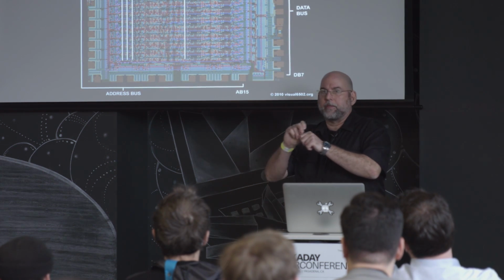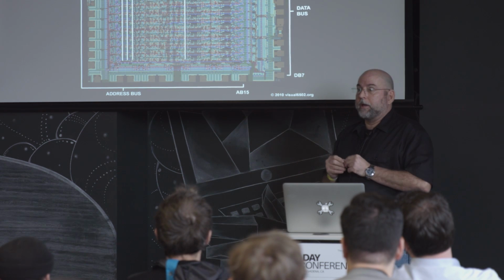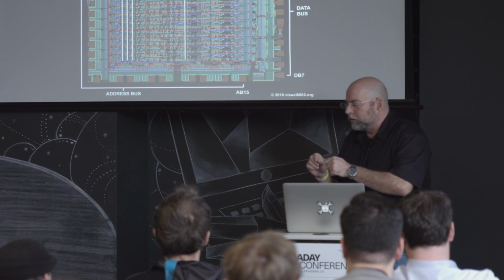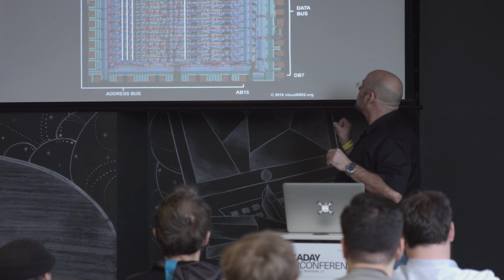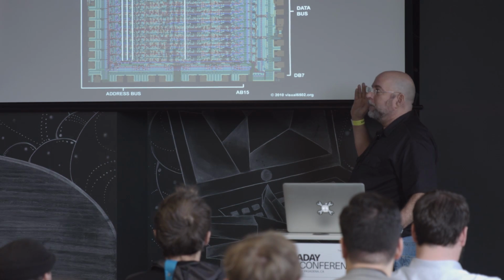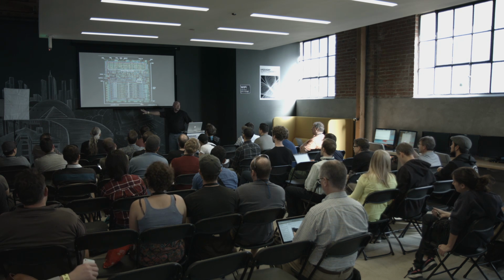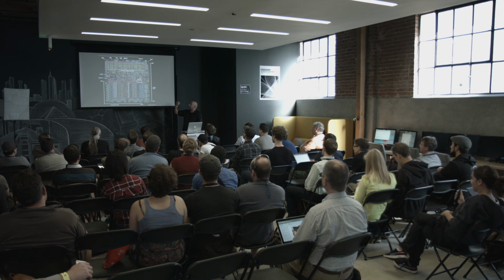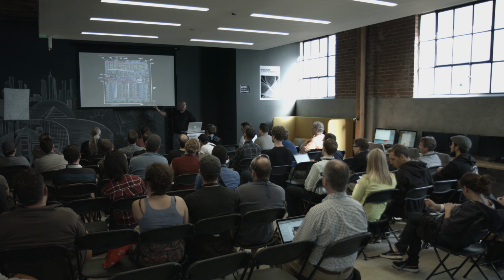They would cut ruby lith and expose it and make photographic negatives and then reduce them. And you could be a brilliant IC designer, but it mattered how well you went in and checked how those ruby lith layers had all overlapped. Very, very tedious. Well, one of the things that got through was the chip was using a little too much power, and they laid, you remember mood rings from the 80s, right? Those crystals, they laid a crystal on this that's made to do it, and they found a hot spot, and one of the things they found was just a 200 ohm resistor from VCC to ground, right? And he finds it with a mood ring, so very 80s in that.